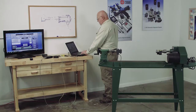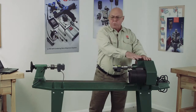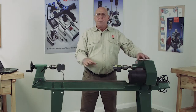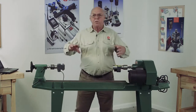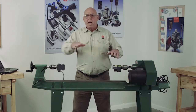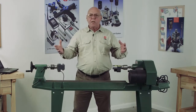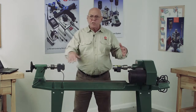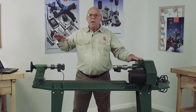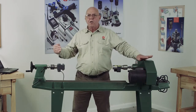I'm going to make a new project here. The object is I need this headstock to be parallel to this bed, but I also need to know how flat and straight this bed is. If this bed has a twist in it — in other words, it's not flat or it's not straight, it's curved — I need to fix that before I can ever make this parallel to it. If this is curved or hilly, there's no way I can make this straight line parallel to a curve.